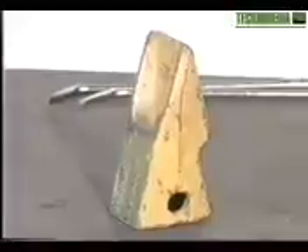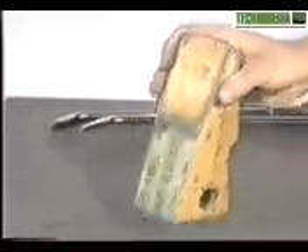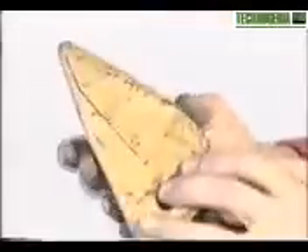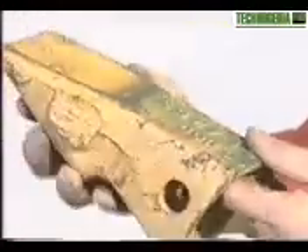The initial work made on the piece to hard face and the spraying of powder are essential steps in the procedure. They generate a good welding. The temperature when applying the product has to be considered too. The quality of the deposit is dependent on the clearing of the surface to hard face. Previous hard facing deposits must be completely removed, except for initial Technodur or Technosphere deposits.